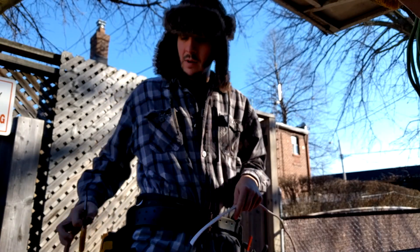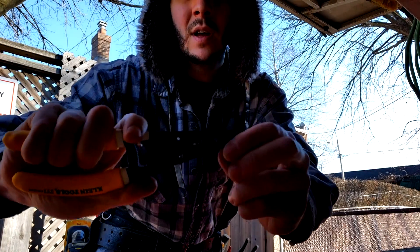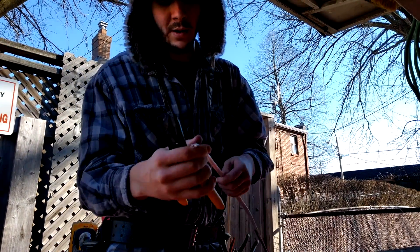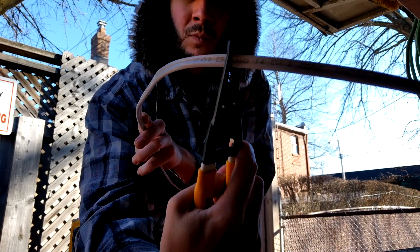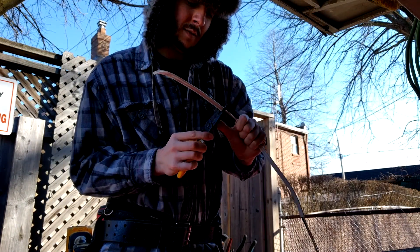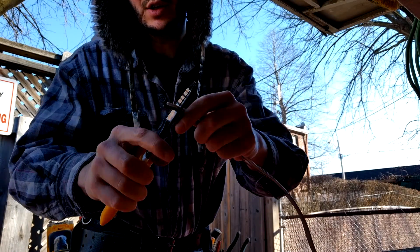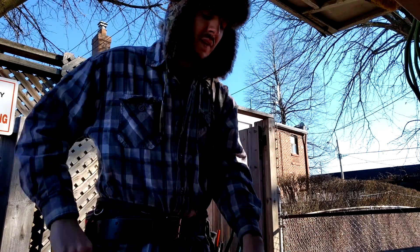I used that method for a long time until I picked up this set of Klein pliers. These are residential Romex strippers and you'll see they've got grooves set up for 14.2 and 12.2, plus individual conductors on the end for 12 and 14 gauge. You just take these pliers, put the 14.2 inside the designated groove, and close them. It will put a nice score on the wire — nice and clean — and you can use your hands or the pliers to pull the jacket off quick. Then you can use the individual conductor strippers at the end to strip all your conductors at once. That seems to be one of the fastest methods I've come across.